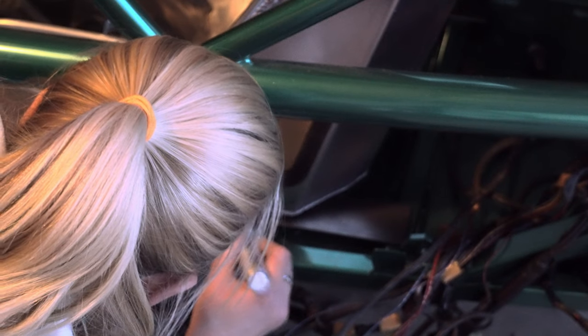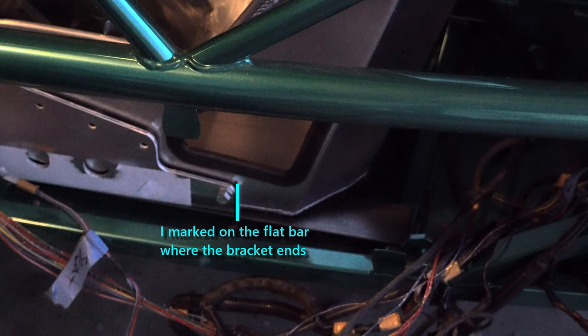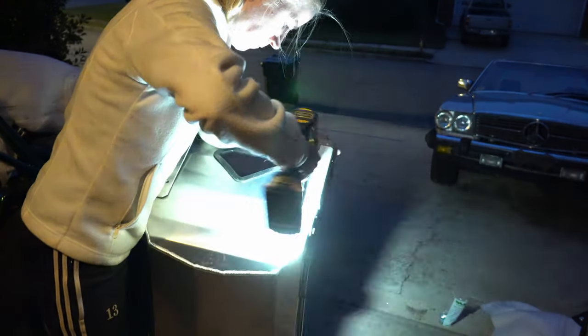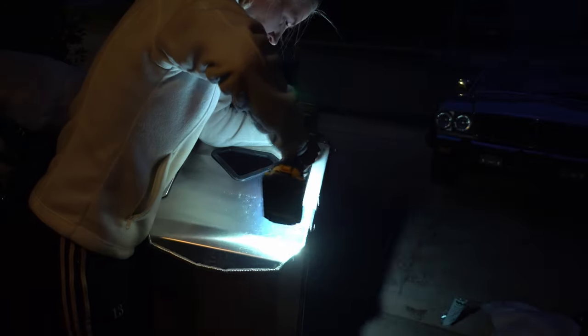With everything in place, I marked the position of the back of the side bracket onto the flat bar stock. This allowed me to remember the position of the seat onto the bar stock so I knew where to mount it later. With the layback angle I chose, I ended up needing to drill two holes into the bottom of the seat in order to bottom-mount those onto the flat bar stock.